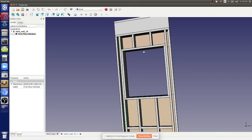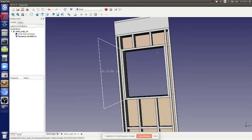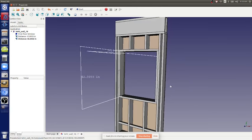The hole for the window is basically like 1/2 inch larger than the window itself. So when you buy the window, it says it's got this rough opening. And I think here it's like 36 by 42 or something like that. We can measure that readily. So the rough opening for the window, yes, it's 42 by 36. When you get these windows at the store, it's going to be called a 36-inch window, and that refers to the size of the rough opening.